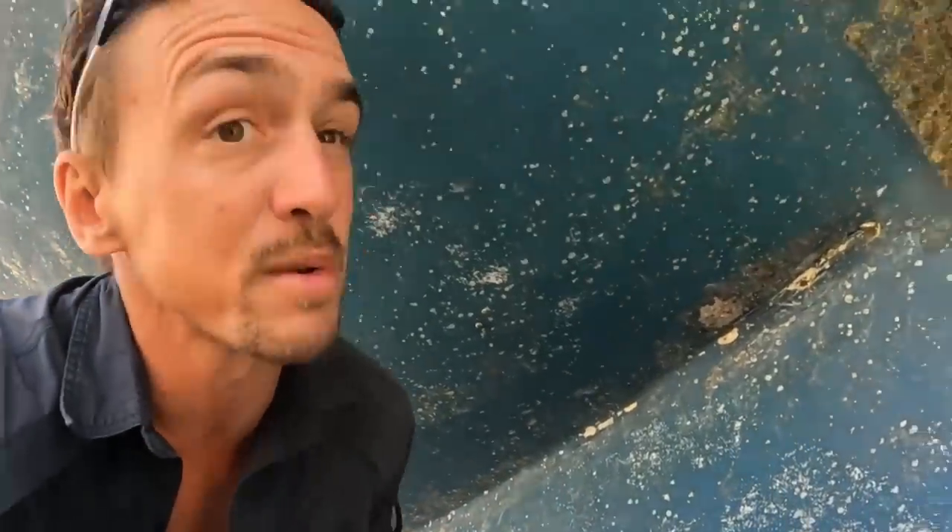Moving on to the bottom as well — you see this area? This is where the strap was on the bottom of the boat when they lifted me up, where the pressure washer couldn't reach. It's kind of gross, but I'll probably just chisel it away with a paint scraper and then sand it. Bottom painting here, really not that difficult.